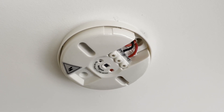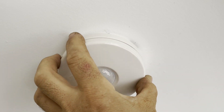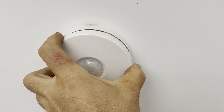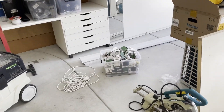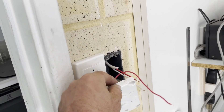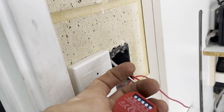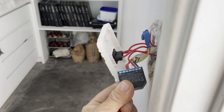I've finished wiring up my sensor here. It was pretty easy — there's plenty of room to connect the wires up there. I'm just going to pop the cover back on and line it up. Now there are a million different ways to wire sensors. In my case, I'm going to use this little device here and do some modifications. I'll show you a diagram of what I've actually done and why. So I'm going to relocate this double switch to my garage side and install this in here to replace the Shelly 2.5.